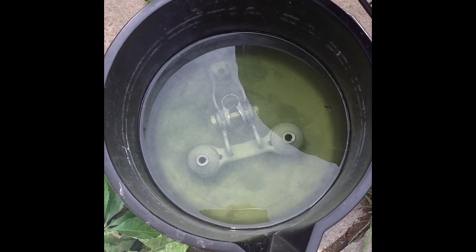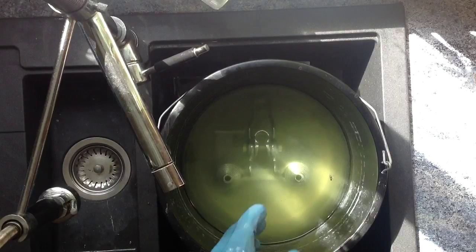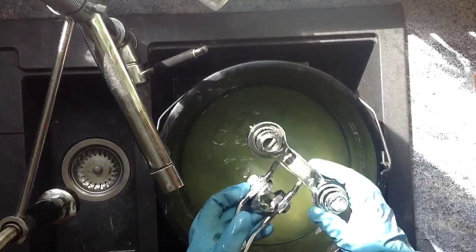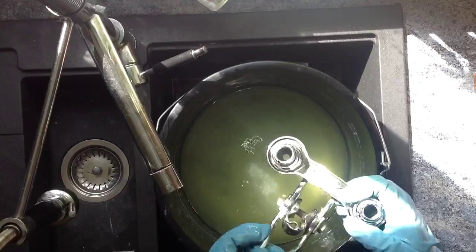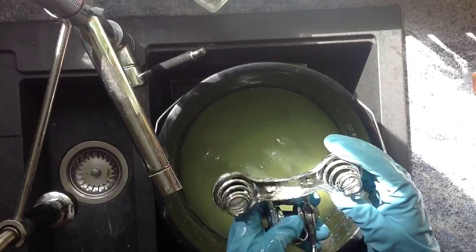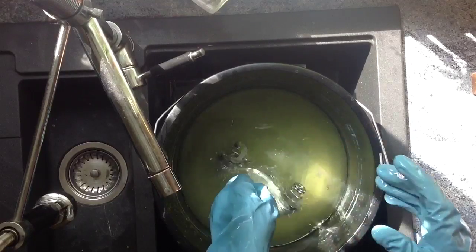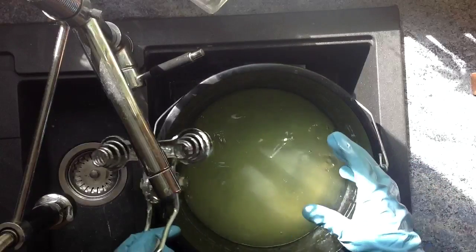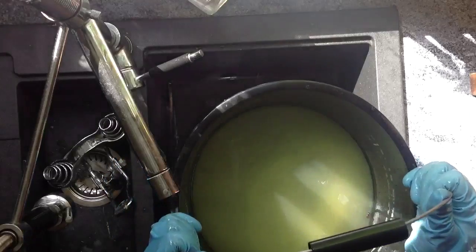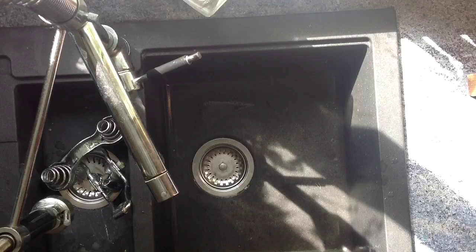And here it is the next morning. Seems to be a lot of sediment settled to the bottom. So take it back inside and put it back in the sink. As you can see I haven't touched this since I put it in the bucket. Most of the oxide appears to have come off. There's still a bit of speckling, still a bit mottled around where the chrome started to peel. Apparently pouring some bicarbonate of soda into the bucket will neutralise the acid, then it can just be tipped straight away.